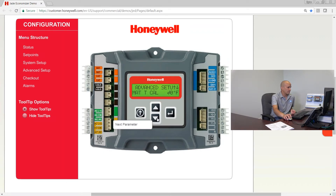The next group of settings — mixed air temperature calibration, outside air humidity, return air temperature, return air humidity, and discharge temperature — are all the same concept. You're calibrating those individual temperature or humidity sensors. You can add or subtract a certain number of degrees or percentage points to make each sensor match what you're actually reading in real life.